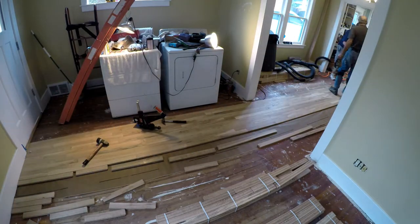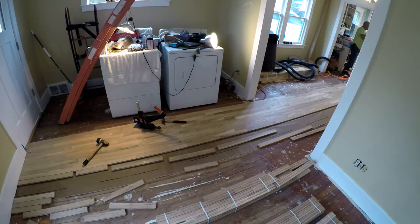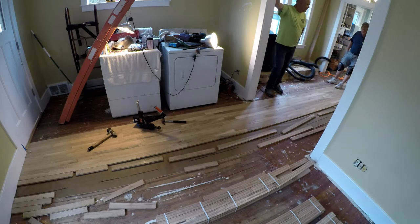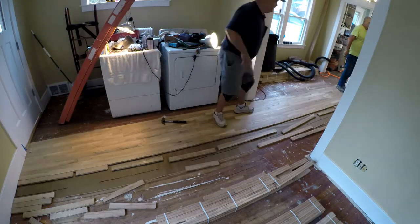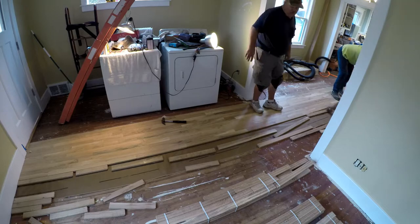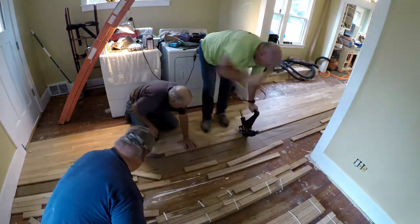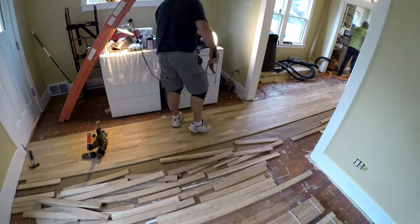I'm working in the kitchen trying to get a straight-line wood setup, but there is also a lot of extra work on the kitchen floor where we tore up all the old vinyl. There were four layers of floor in there, and the bottom layer was glued down with a black mastic — also called cutback adhesive. It has been a real challenge to get out. Some came out easy and some just did not want to let go, so I'm going through with a scraper, hand-scraping and cleaning up so the wood will go nicely in the kitchen.